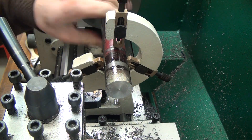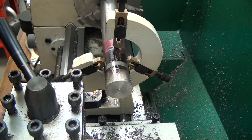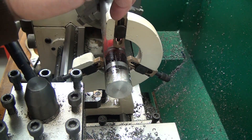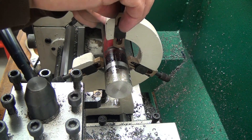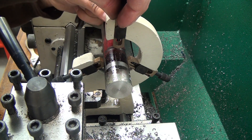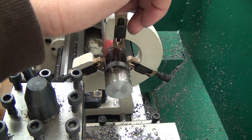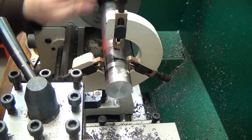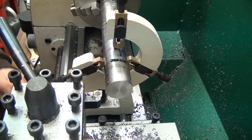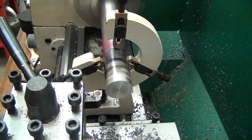Clearly we've got a major problem, and it turns out to be that top finger. Once I loosen this 14-millimeter nut, you'll see how far it pushed that finger out of place — it's got to have been like a sixteenth of an inch. There you go. So this time, a little bit more pressure on the thumb screw to hold it down while I tighten the 14-millimeter nut, and that seems to not pinch the work. I guess that's set up pretty good.